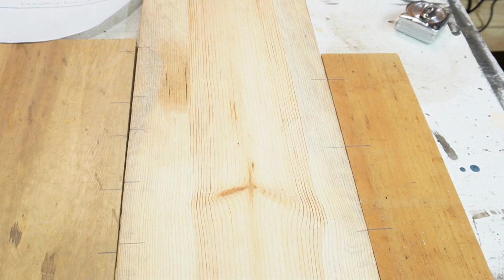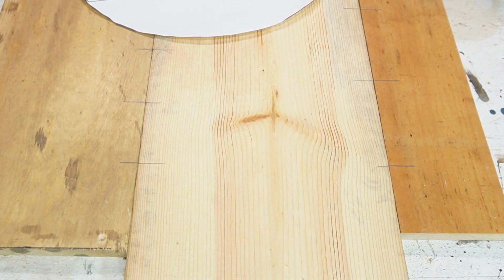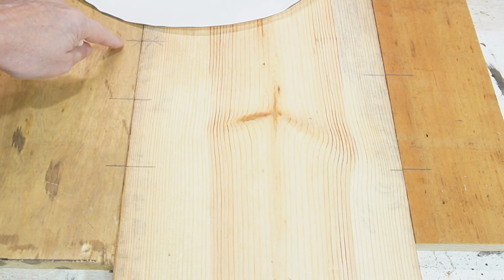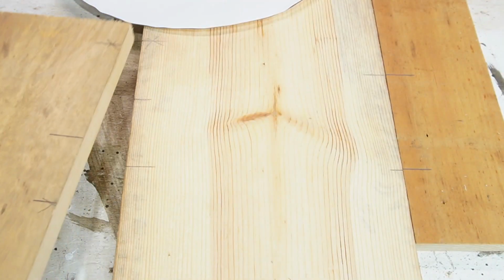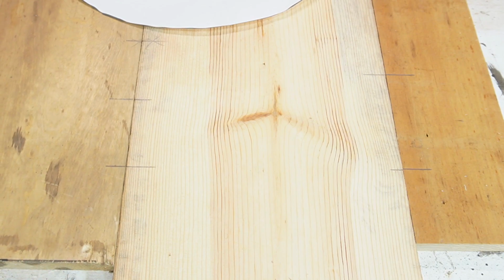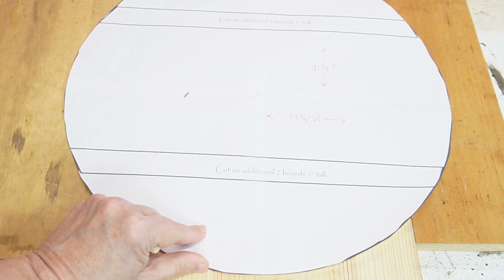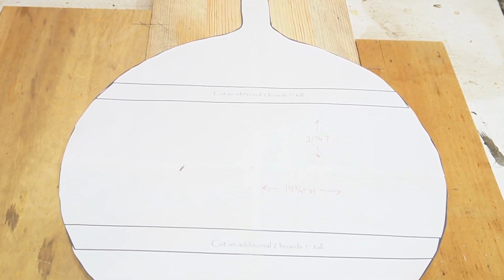We're setting up the wood vise, and we're going to drill our holes. He already made marks in the wood, and I'll zoom in to show you those. These are the marks where we're going to drill into the side of the wood for the dowels. And we'll simply use the jigsaw to cut out our pattern as such. Now I need to zoom back out so that you can see that.